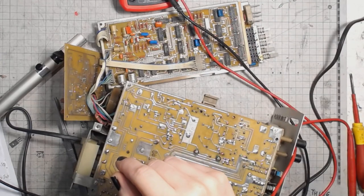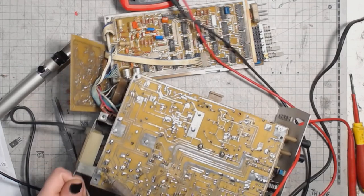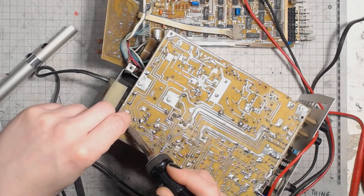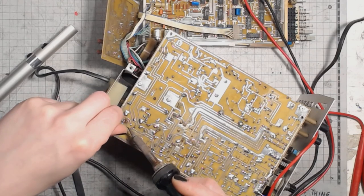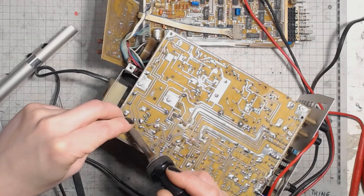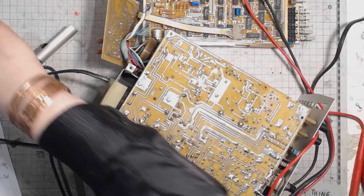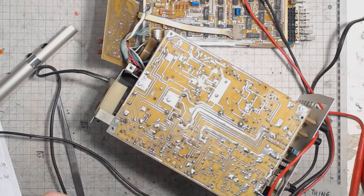And by the way, a teeny tiny tech tip from me. If you want to clean the hole in the PCB, you can do it by heating it up and using any kind of needle. I used syringe needles from my hormone replacement therapy. And that's how you'll get the hole again. So now I will look for the PNP equivalent named BD140.